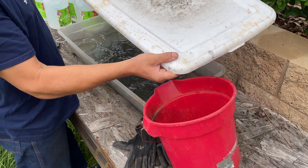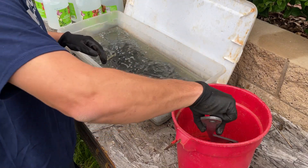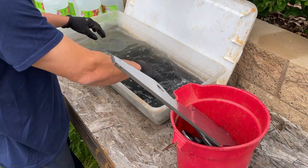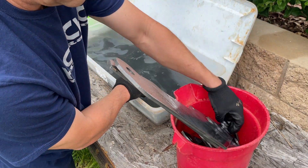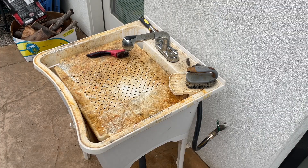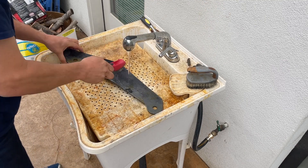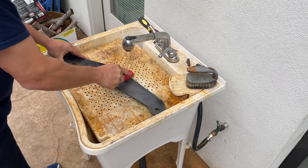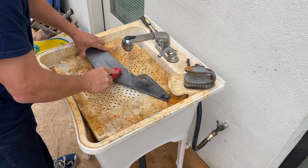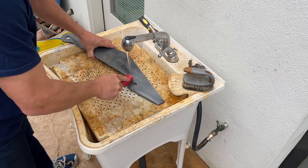The vinegar I'm using here is fresh — it's pretty clean, almost looks like water. But the more you use it, the longer it lasts. I literally have vinegar I'll use for months. It turns a soupy brown color but still works and still gets rid of the mill scale. Make sure you put on some gloves because it will discolor your fingers a reddish brown, which I'm sure isn't great for you. After that, I take the parts over to my sink — it's got to be a sink you're willing to get destroyed, you can see the brownish staining you can't get off. Then I use a stainless steel brush to get the mill scale off, and you can see it takes it down pretty much to bare metal on the first try.